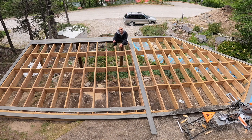Now what I'm gonna do is I've squared up the whole pile of ends. So I'm just gonna lay all these ends against that wall, dry fit. And then I'll start doing an install off this side here, full boards, working back, and not gonna cut them to length. Gonna move this out of the way and then chalk one chalk line across. So the first two boards I put on, the first board there and the first board there, will be cut right. Then I'm gonna chalk a line or draw a line on it all the way across and make a nice straight line before I install this one and do the same on that side.